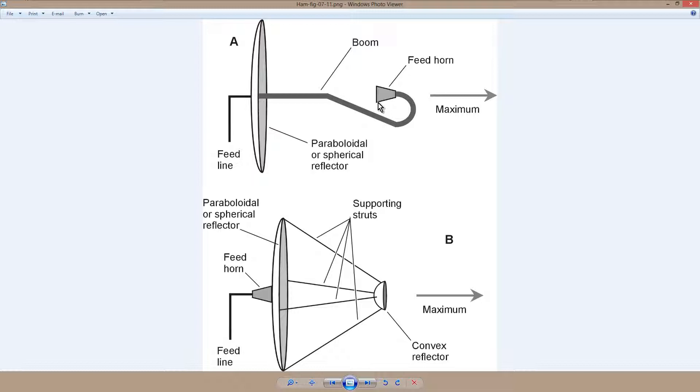Dish antennas, if large enough, can also work for moon bounce, although rarely will you see a dish antenna for moon bounce at a frequency lower than 1296 MHz in the amateur radio bands. So this is a unidirectional antenna. It should be at least several wavelengths in diameter, but the larger the diameter, all other things being equal, the more gain, directivity, and the better front-to-back ratio you will have. You can have a solid metal dish, or if it's a very large dish, it can be a wire mesh or screen. The Cassegrain dish antenna design is used for very large dish antennas, which will eventually interest you as an amateur radio operator, particularly if you want to do moon bounce communications.